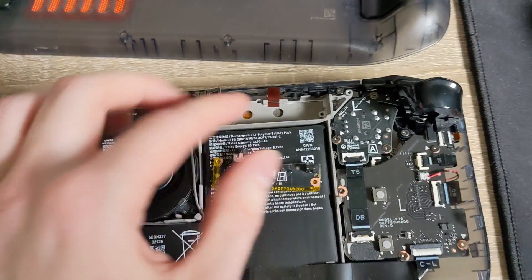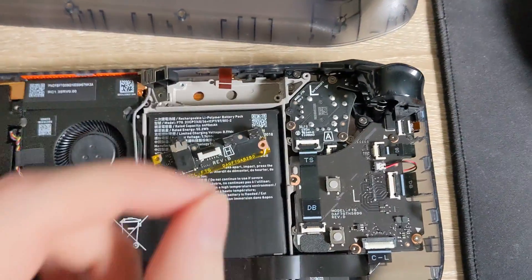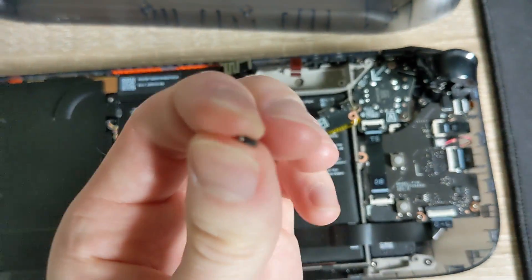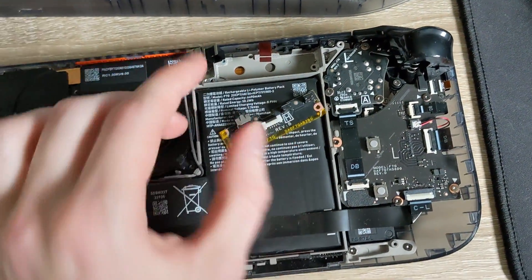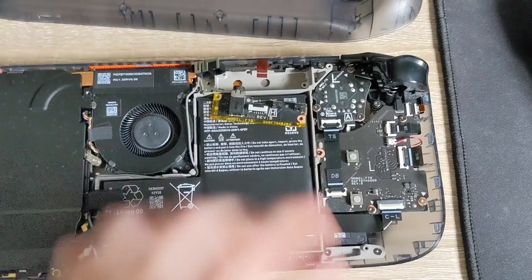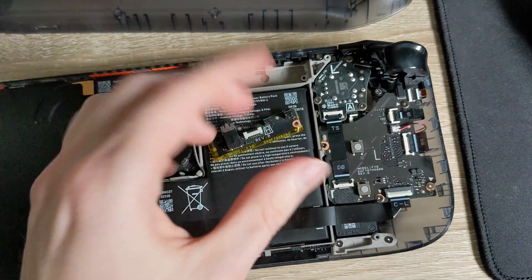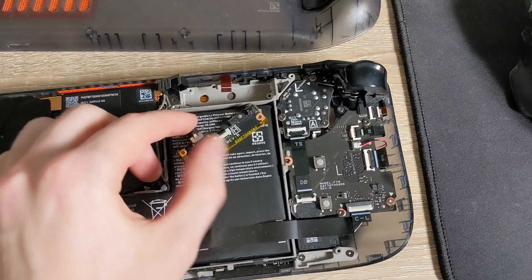On my channel, we're putting kapton tape on it. I thought about nylon screws, but you can't get nylon screws in M1.6 — the precision tolerance is too small for nylon. So I'm just going to keep the metal screws in a Ziploc bag, double-sided tape the board down with kapton tape on the bottom. Just putting kapton tape around the screws isn't enough — you have to do the bottom and let the stabilizers hold it. Honestly, I don't recommend doing it at all. Just reach out to Valve and let them know it's their problem.